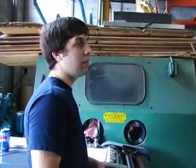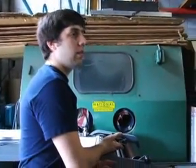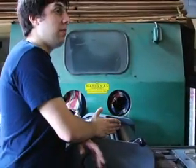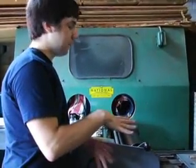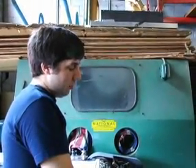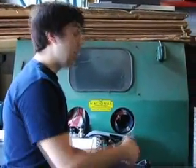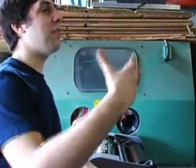So good wash-up is necessary. A real wash-up between colors would be: take all your brown off with a slow evaporating solvent, then put a fast evaporating solvent after you've cleaned all that. Then you put white ink on the press, run up the white ink as if you're going to print a job in white, then clean all your white off and put your yellow or anything else on. Big print shops would have doubles of the rollers — colored rollers and dark rollers — so that made things easy.